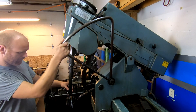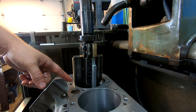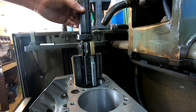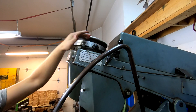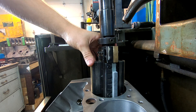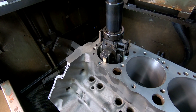By grabbing this I'm in control of the level of the head. When it comes down here, our guides will fit, but we've got to make sure our stones will fit. In this case the stones are sticking out farther than the bore, so it's not going to allow me to go down. Up top here is the adjuster for the mandrel — turning it this way will retract my stones. With the stones retracted, we can now fit this inside the cylinder like so.